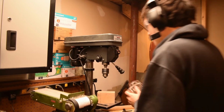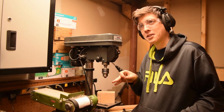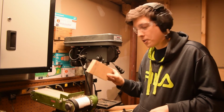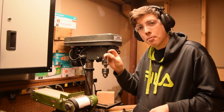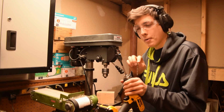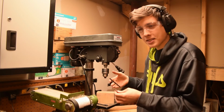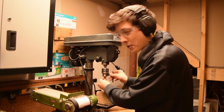So the last time you saw me at the drill press, I was about to make a horrible mistake. So unless you have a vise on your drill press or a milling machine, don't use spade bits. So this time the difference is I squared up this block really good so that I can use a drill press to drill a very straight pilot hole smaller than the width of the screw portion on the spade bit. The last one I didn't bore the hole all that straight. Because I was coming at it with the angle and the vise isn't square with anything, and the mallet head wasn't square with anything. So yeah, we're learning.